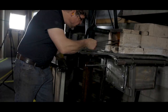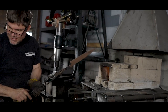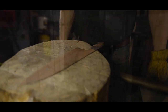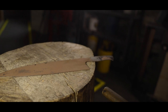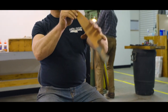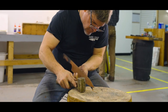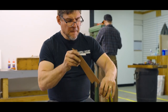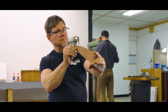After quenching, the blade is held over the flames until the blade is just hot enough to make drops of sprinkled water dance on it. Care must be taken to reheat the blade evenly or else some spots might get too soft and others too brittle. Water quenching is very severe and often distorts the blade by bending or twisting it. A brass hammer and wooden stump are used sparingly to gently coax the blade as straight as humanly possible.